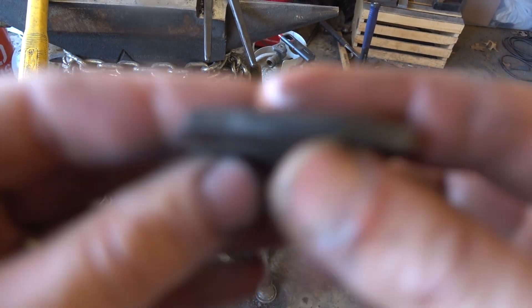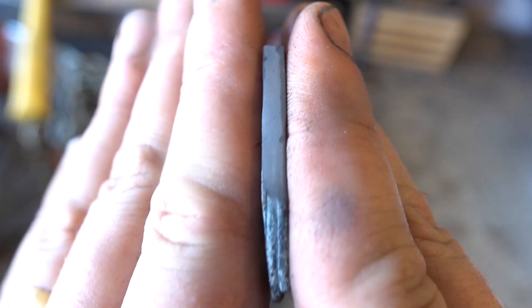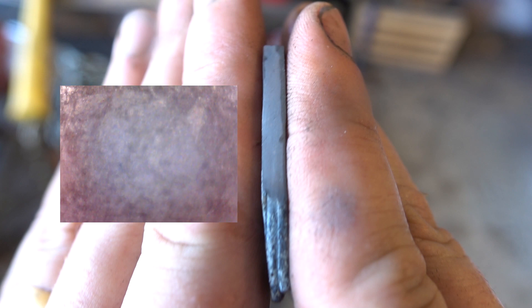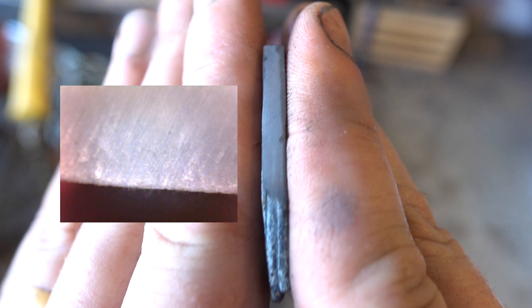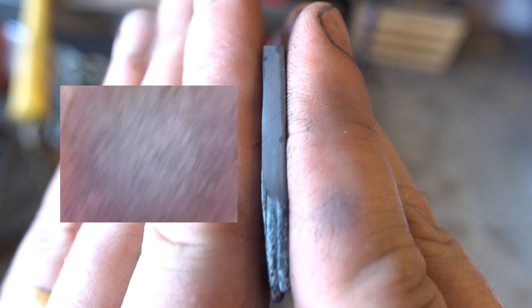We've etched it, we've cleaned it up, let's take a look. Except for a few small, tiny stripes where the different metals came in contact for forge-welding, the carbon really appears to have spread full thickness now. Here it is under a microscope — you really can't see any of those stripes that were visible in the original carburized iron piece. Migration is nearly complete; it's very homogenous appearing.